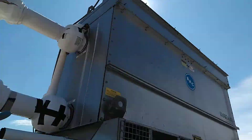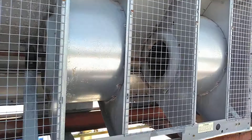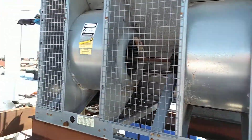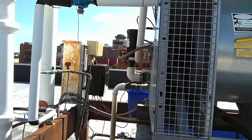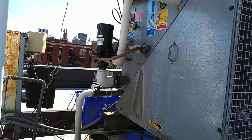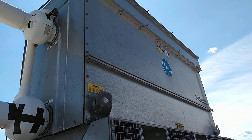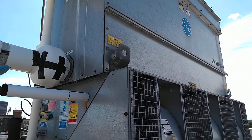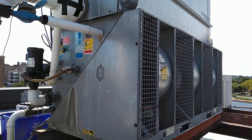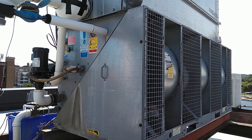Dampers open. The second stage of cooling for the coil is a fan that blows air across. The third stage of cooling is a pump that sprays water across jets in the top of the tower that drop down across the cooling coil to provide evaporative cooling.